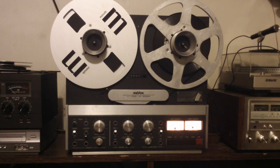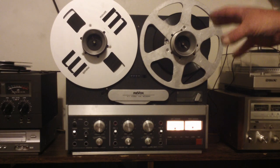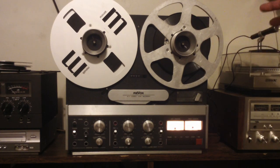I've spent a lot of time on here. I got one of Erhardt Audio's cap transistor and trimmer kits. He uses Nichicon caps in those kits and I love those things, but in this one I used mostly Elna Silmic 2 capacitors, and some Nichicon and some of the other axial caps.